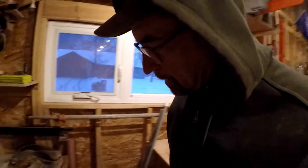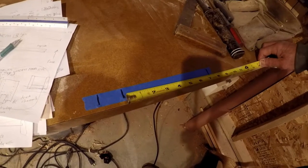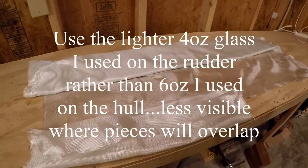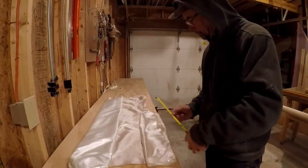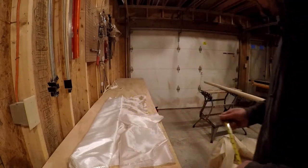For the glass wrap, I taped around the base — just under nine inches to get all the way around — and at the mast head, seven and a quarter. I think I'll use four-ounce cloth; that'll be less visible and less ugly. Three or four-foot pieces, and this little leftover from where I cut out for the rudder — one of those will get us the whole length.